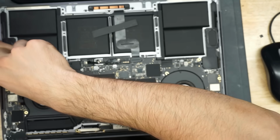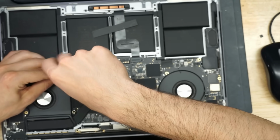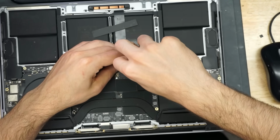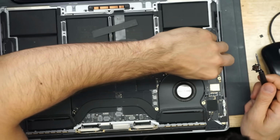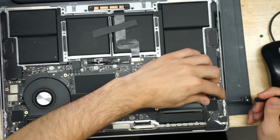And again, you can tell me if you think I'm wrong, but from what you saw under that microscope, did you see any liquid damage there? I'm fairly certain that when we take that BGA chip off the board, you are not going to see a single piece of liquid damage under that. You're just going to see that it blew itself up. We're almost there. Are you excited? We just got a couple of screws left to take out of this thing, and we are going to be ready to replace that TPS62180 with a fresh TPS62180